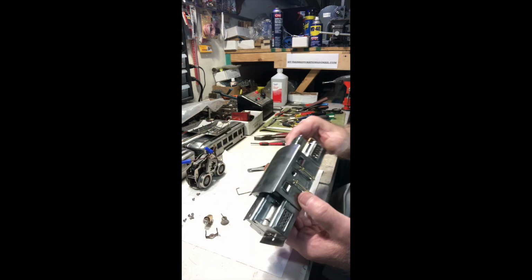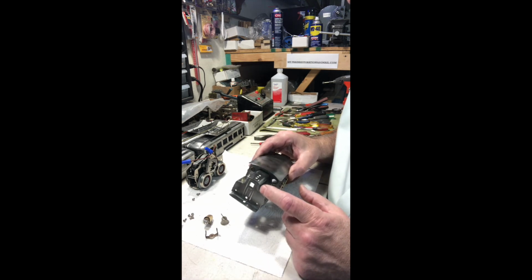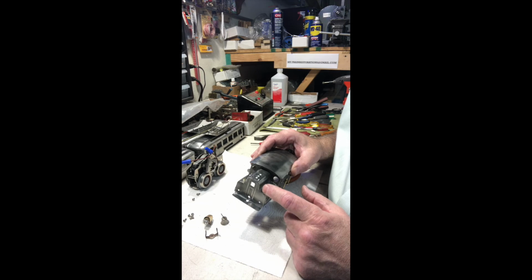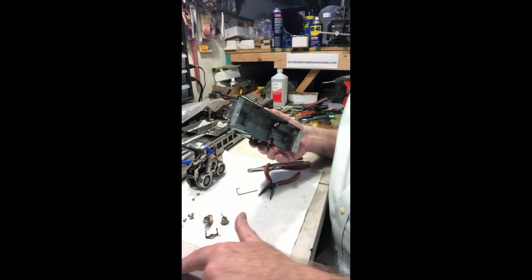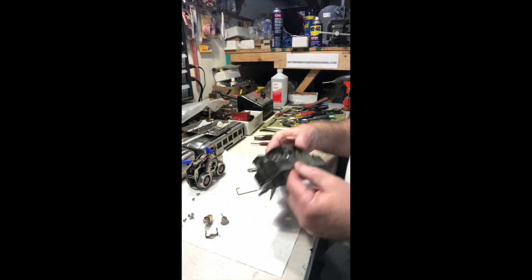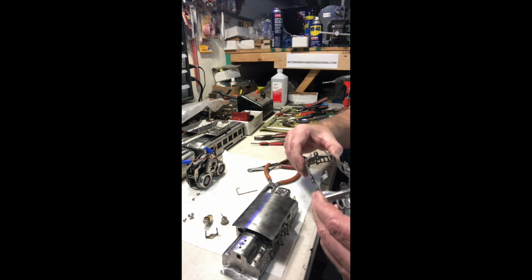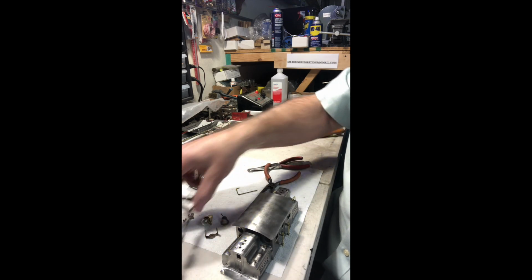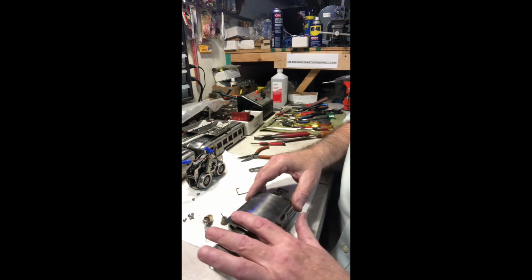And if I powder coat it and it needs to go in the oven, I have some oven rated tape to use on these kinds of things to tape stuff off. So it's pretty cool to have that ability. And this will just end up being black. I'll probably powder coat it black. That makes it more durable. So when it does get banged around a little bit, the powder coated system is more durable than paint.